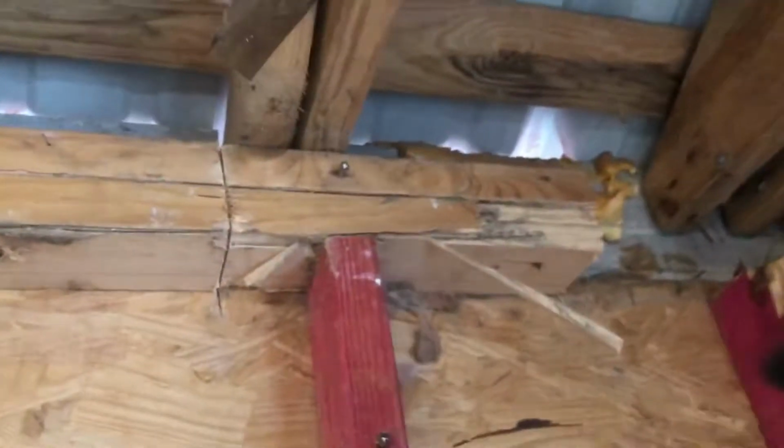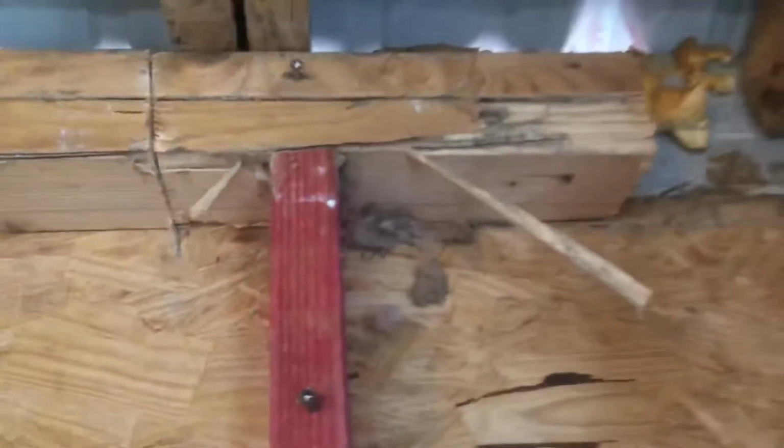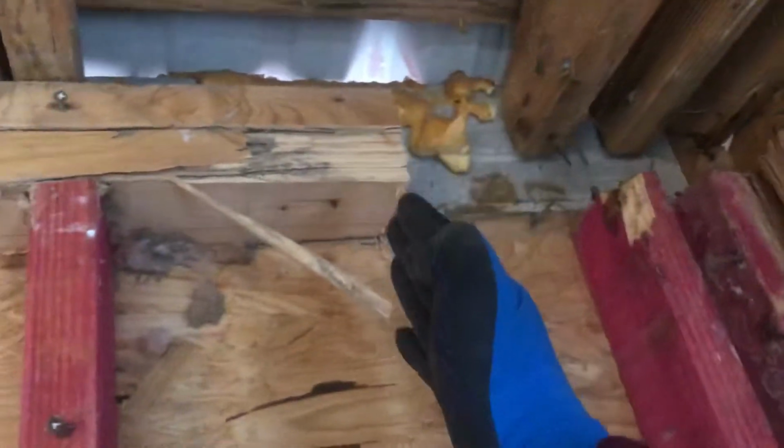But anyway, what I'm doing is I had to obviously pull off the roof, and we're actually going to open these ceilings up, so that's going to be pretty cool. I'm exposing those two top sills, that's two 2x4s, and I'm slicing away small chunks of it so I can remove it slowly and surely without affecting our roof joists.